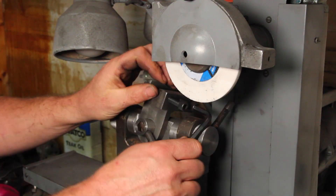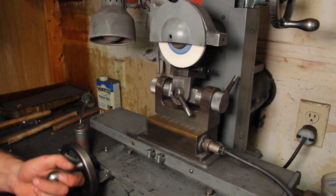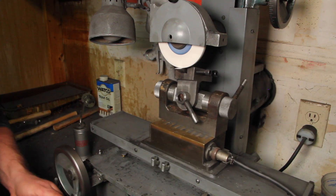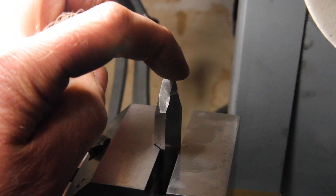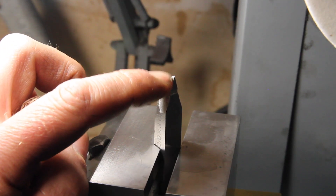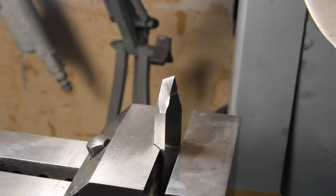I'm going to leave the important angle set and just flip the tool bit over — I've reset the side relief. I didn't bother cleaning up all of this because that part is never going to get used. But that came out pretty nice — it has a knife edge on it now and a point. I need to put a little flat on there. I know the width of the flat and I know the angle on the top is 29 degrees, so from that I can calculate how much I need to grind down. I'm just going to touch off and grind down to knock that flat in at the right width.